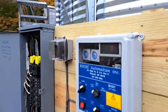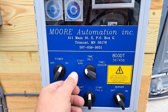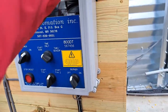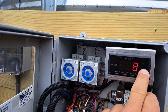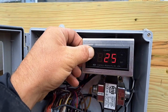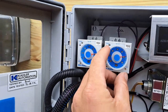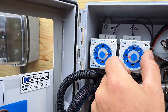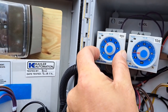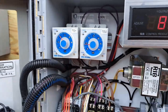Our pressure comes up, that should be good to go. Now we're going to fill it full of corn and start it back up again. Once we're full of corn, we're going to set our temperature to 125 to start — that's just a starting number, we aren't necessarily going to stay at that. Our cool time is in minutes; we're going to put that down to about three minutes. Drying time is in hours; we're going to put that to four hours — we will not go over four hours for drying.